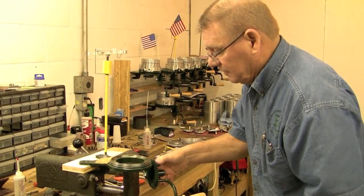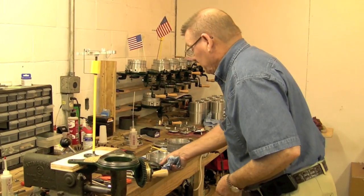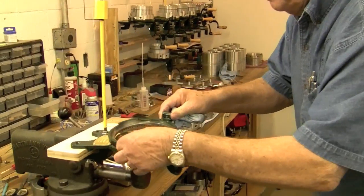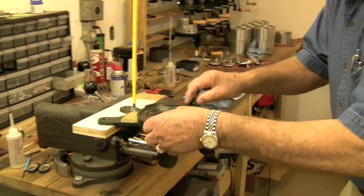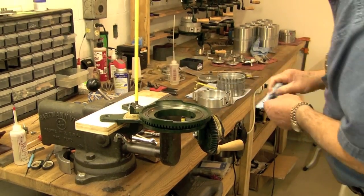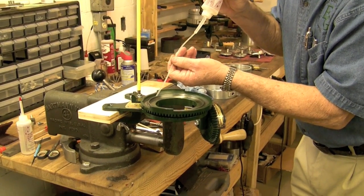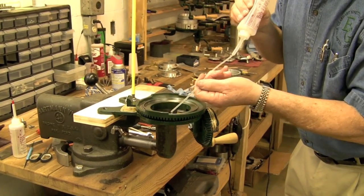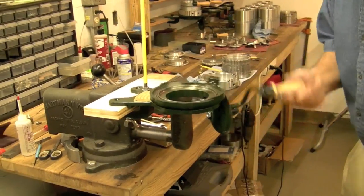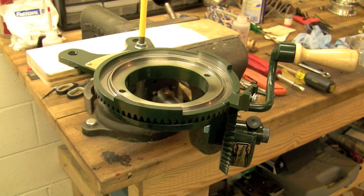You can run your gear and see if it's all secure and tight. Then to reassemble, after you've cleaned them up, just set them right back down on the gear ring. Make sure the gear is engaged. Put a little oil on them — a regular oil that we supply with you. Oil that up real nicely, and you need to turn it and make sure that oil gets down on the runway lands that it goes around on.